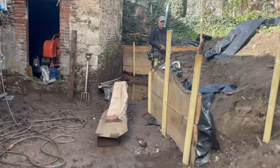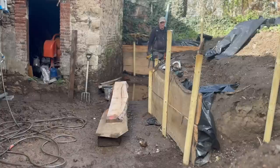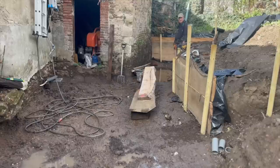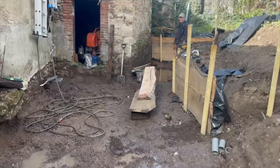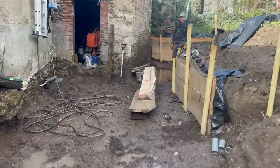I am collecting rocks and stones and building debris from the site where I come across it, because I'm gonna fill up concrete with all that stuff. And then later it's gotta be more dry, because it's so incredibly swampy here because of the rain. Once it starts drying a bit more, I can level, flatten the area a bit, and then start digging trenches for the French drain. I have a rough idea.